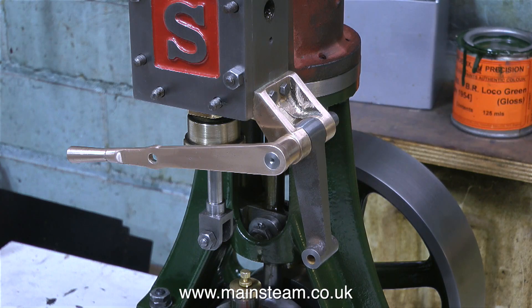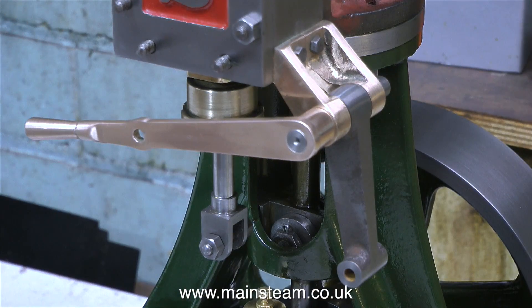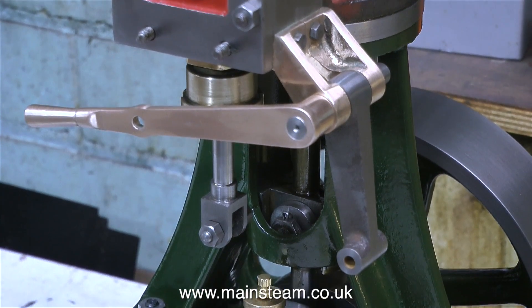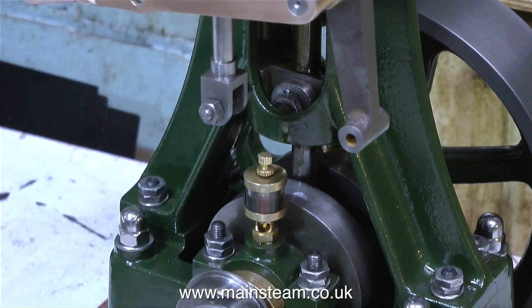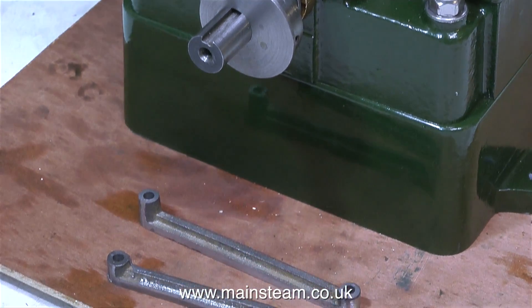It's not perfect, but it's looking okay. Here is the cleaned-up reversing lever fitted to the engine in its approximate position. I need to cross-drill the reversing lever and the drop arm, and then taper the drilled holes using a taper reamer to take taper pins — and that will hold the whole assembly together. But that's it for now, thanks for watching, and I hope you found it useful.